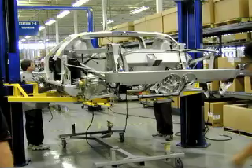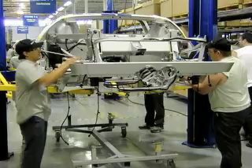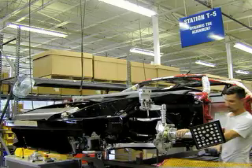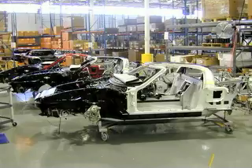As with any assembly line procedure, it's crucial to have an adequate supply of the proper components ready and waiting at each stage of production. The front and rear suspensions are made up of sub-assembly components assembled before they are bolted to the vehicle. A four-wheel alignment that actually measures wheel angle throughout the movement of the suspension is performed, ensuring that each wheel stays within spec at speeds up to 150 miles per hour. The alignment machine is also connected to the Wixom plant, where the GT's final assembly takes place. The final brake components, including the rotors and calipers, are installed and checked with a high-pressure vacuum tool for leaks. At this point, the car's chassis assembly is officially completed.